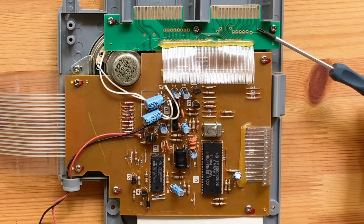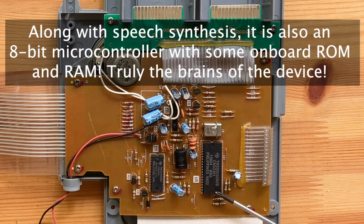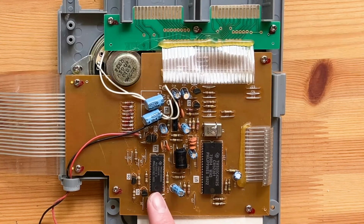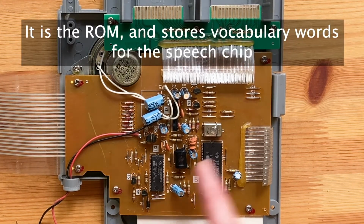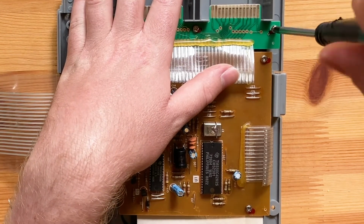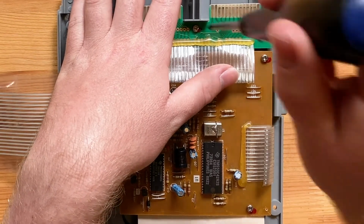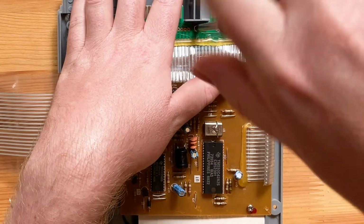We've got the cartridge headers here, and I had a look. This here, the TMS50C42N2S, is the speech synthesis chip that actually powers this computer. So that's great to see. Very cool. This other chip I couldn't find online, so I imagine it's some kind of support chip for the speech synthesis chip, but that's pure speculation. I have no idea what I'm talking about, but couldn't find it online. Incidentally, I did find the data sheet for the speech synthesis chip, and it's really cool. It's got very detailed instructions about how to actually run that chip.